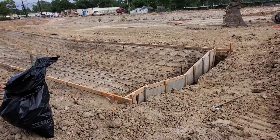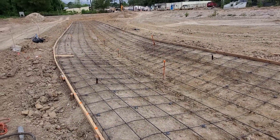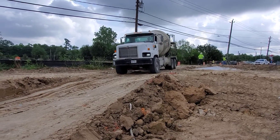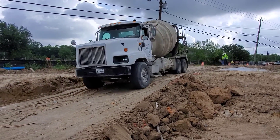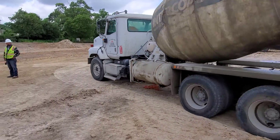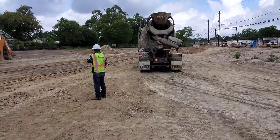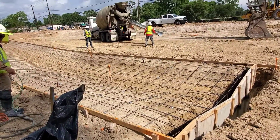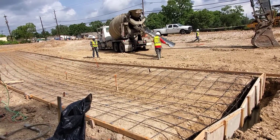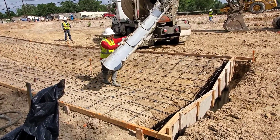The proposed channel will be 16 foot wide with a depth of six inches. The rebar is a number four on 12 inch centers. The concrete truck arrives carrying 10 cubic yards of concrete, which is the maximum weight allowed on the roads in Houston. The concrete is a structural mix, or a six sack mix, with one and one half inch aggregate. That means the concrete should achieve a minimal strength of 4,000 PSI in 28 days as per the engineer's design specification.